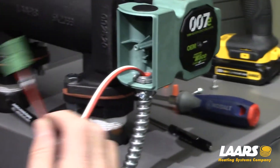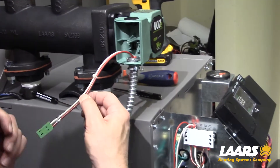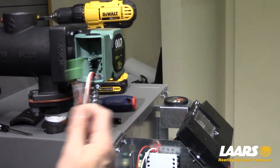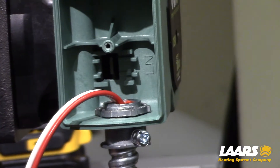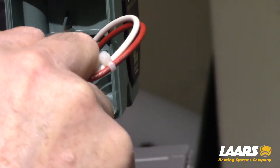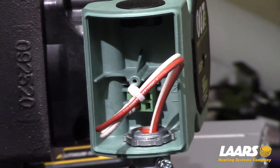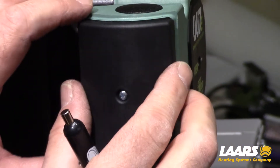If you don't have a small screwdriver, just wire up your red wire to the black wire, white wire to white wire. The red wire is your line voltage. In here you'll see L and N. The Molex connector can only go in one way — just insert it, push in on it and you should be good. Tuck your wires in and install your cover plate.